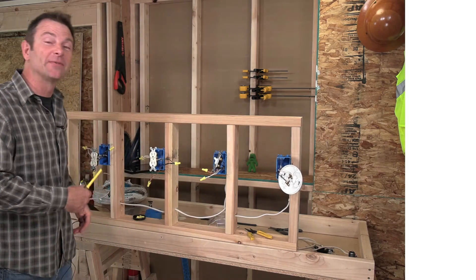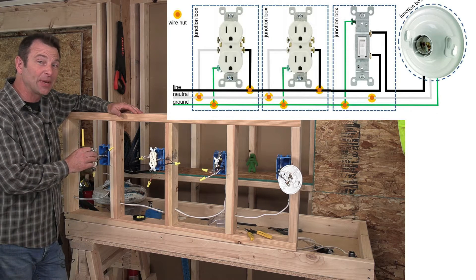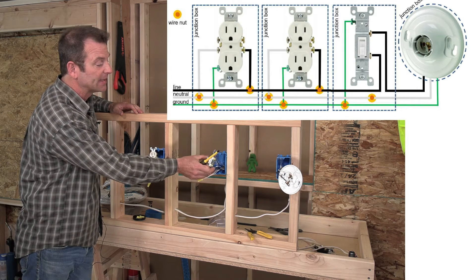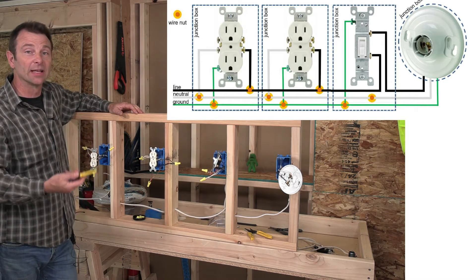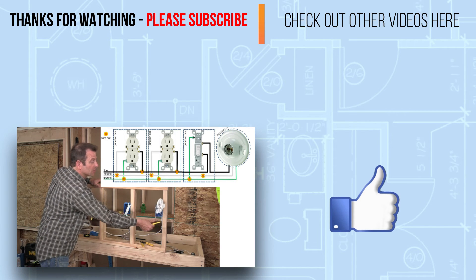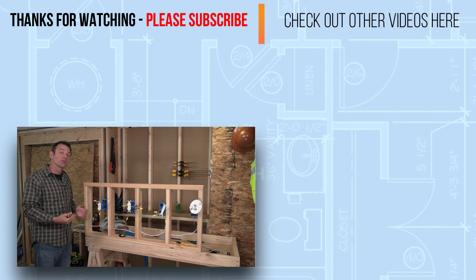That completes my circuit — that's four devices. Let's do a quick review. I've got outlet one and outlet two, hooked in line with the circuit but separated by pigtails for my ground, neutral, and hot wires. The power is traveling through these boxes then to my switch box. This power is broken by the switch through its terminals in the off position, and it's going to send power to my light socket at the end of the circuit with the light turned on. Don't forget that you have a pigtail for your switch's green terminal. Also, don't forget that we do not use our ground wire unless you have a green terminal on your light socket. Make sure that you have all your connections tight, and now you're ready to test.